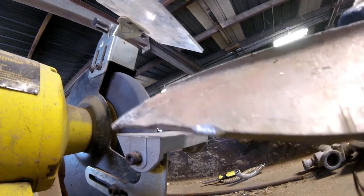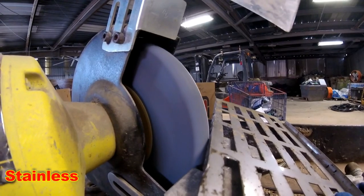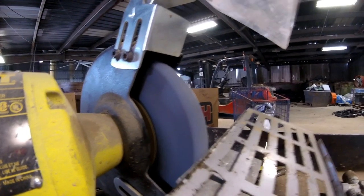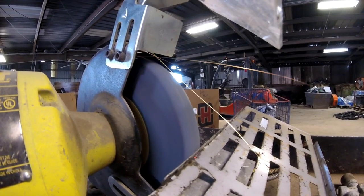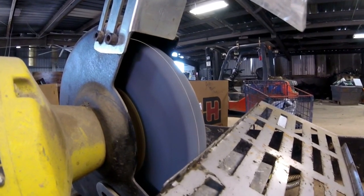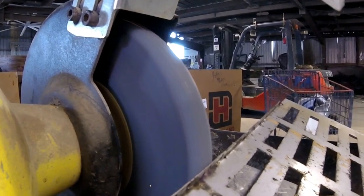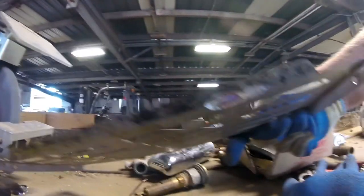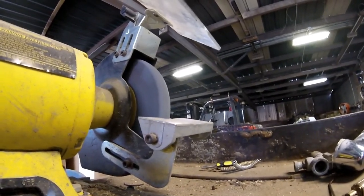This is a piece of aluminum — you don't see any sparks, barely put it on there, barely applied pressure. This is a piece of stainless, and you're going to see long sparks that come off of it. You're going to see how they go around the entire grinding wheel. I'll try to slow it down so you can see them — and it goes all the way around the wheel. That's why I like using the grinding wheel the best, because it's easiest to tell.